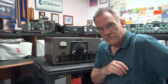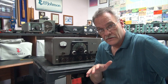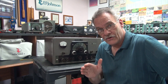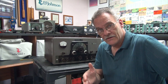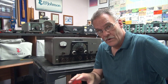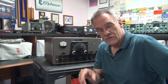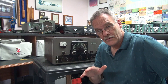The following video is a test of a Johnson Valiant transmitter that came to the shop with no grid current. Turned out that the problem was the band select switch inside of the VFO — it was putting out the incorrect frequency. The way I found that was to go down to the 7 megahertz band, verify the frequency on a counter, and the transmitter worked fine. But when I go back up to the higher frequencies, 10 and 11 meters, the frequency was incorrect. Cleaning the switch and replacing a weak 6CL6 tube brought the transmitter back to life.